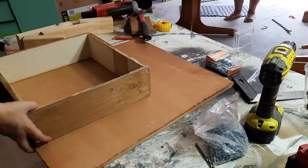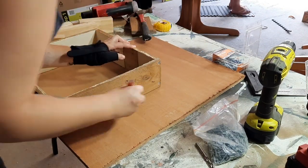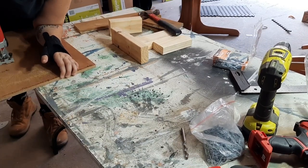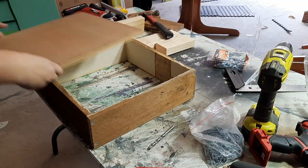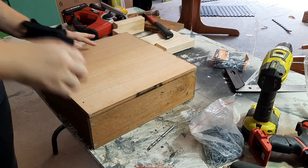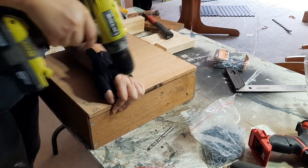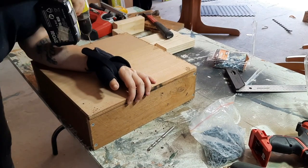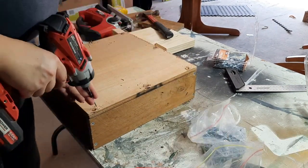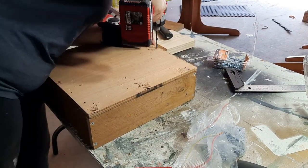Now that that's done I need to put a top on it, so I'm just using some 12mm marine grade ply. You don't have to use marine grade ply but this is just what I had laying around from other jobs. Pretty straightforward — I've just marked out the frame of the box and cut the piece for the top. I'm pre-drilling and countersinking all of the holes, going in all the corners and one in the middle on each side. Be careful that you don't hit any of the screws holding the bottom part of the frame together. Put the screws in the opposite sides first just to make sure it doesn't shift.